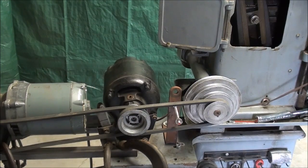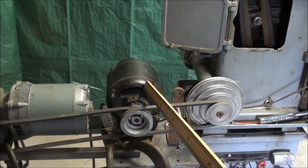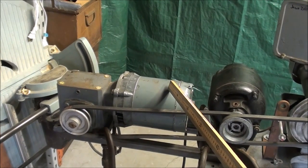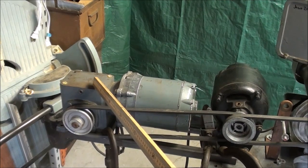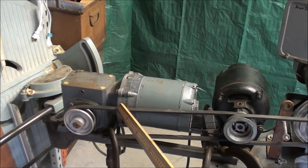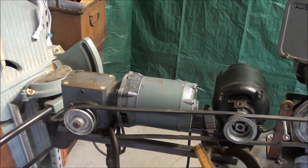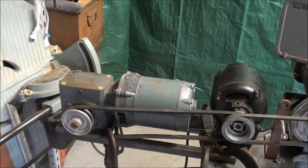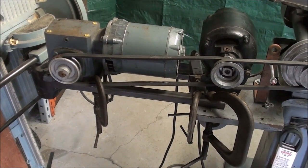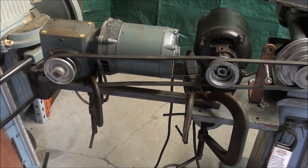What I have done here is I've disabled the regular drive motor, so that's just going to be idling — there's no power to it at all. And I mounted at great effort this right angle gear drive here, and that's going to run this thing really slow, actually too slow. This is just a temporary mount here, some heavy tubing. I've used about six C-clamps, so it's all just temporary. Luckily I own 150 C-clamps, so it was no hardship at all.